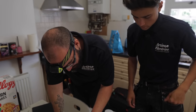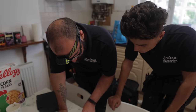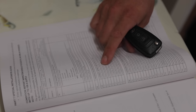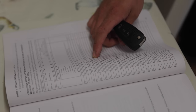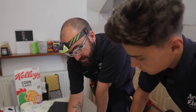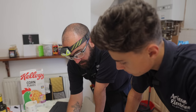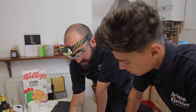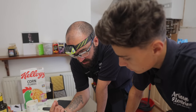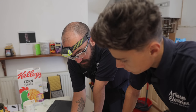Then we've got alternative supply. We haven't got anything here, any micro generation or anything like that. Section 3, which is our earthing and bonding arrangements. Presence and condition of distributor's earthing arrangement. I might put my observation there for that ropey bonding clamp. Put an observation here for it squeezing the lead cable, on that one for the loop supply, because next door might not be getting a good earth because it's looping in and going to the next one and it's only literally just being squeezed together. And then put another one for the state of the clamp and how loose the connections are.